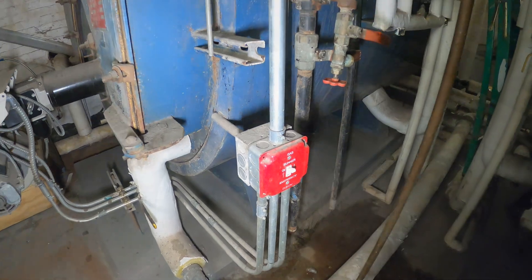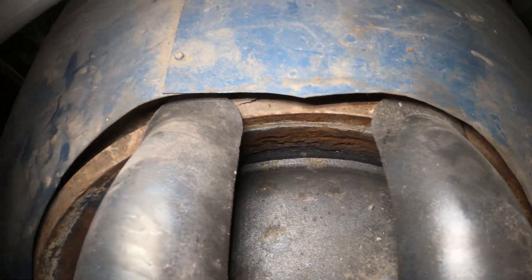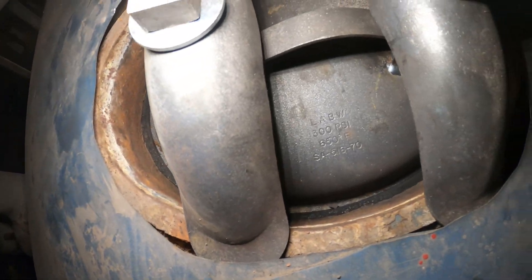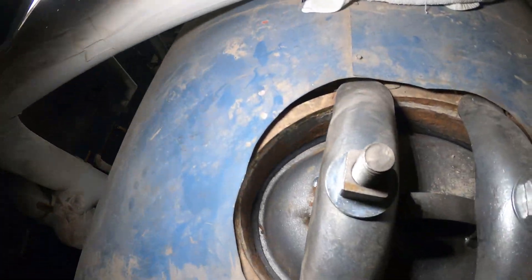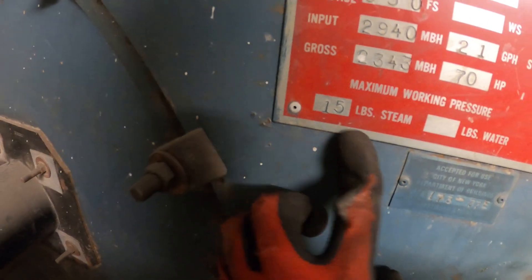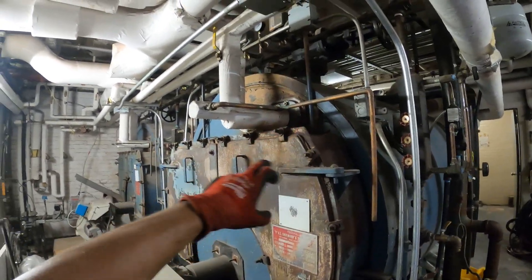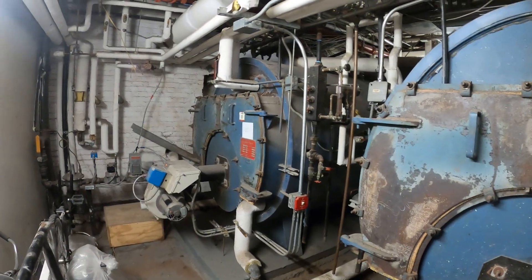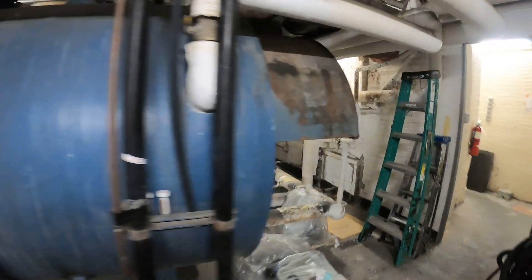I can turn this one back on. Alright, this one turned on. Looking around — everything is looking good right now, starting to get really hot up here. I'm gonna make my way out and I'll be back in the morning for the next one — gotta change both. Right now we're looking good, everything is satisfied. We have no leaks. If we look here it's only 15 pounds of pressure — it's a steam boiler and that's really not much, so everything's good. As far as tomorrow, we have a whole other setup and we're going to be replacing the manhole for that one. It's pretty much the same process — seems simple enough but it's harder than it looks. If anyone found this video interesting or helpful, please drop a like, comment and subscribe. Catch you all next time.